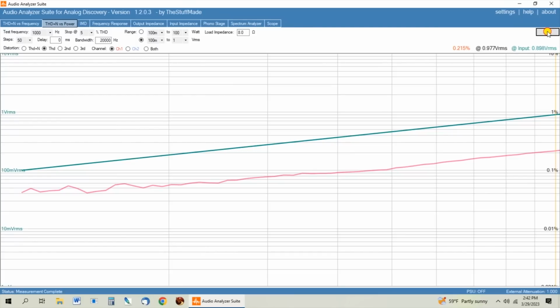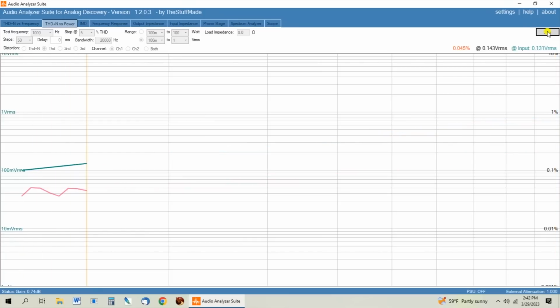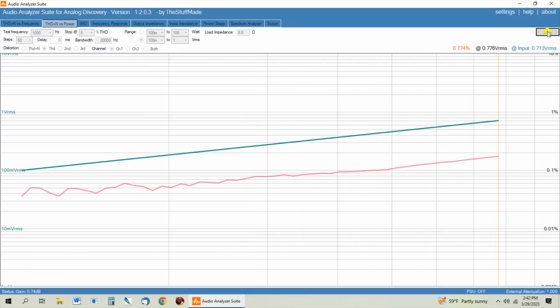One thing else I want to do real quick is pull this again and watch the VU meters and note where they are on the scale. That's 0. And that was +3 on the scale right here at 0.25% distortion. So maybe these VU meters are useful. If you're starting to see them past the 5, you're pegging out the VU meters, you're probably clipping and overdriving this preamp into distortion. And especially if you stay in the black range, it's going to be down at 0.1% distortion. So maybe these VU meters are doing more than I was giving them credit for.